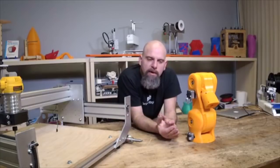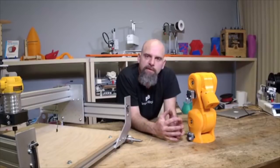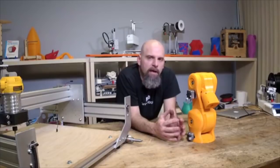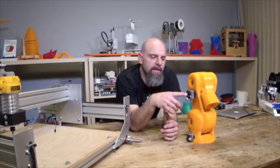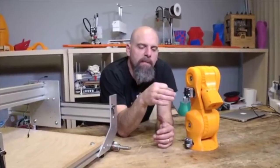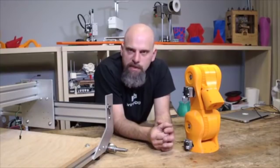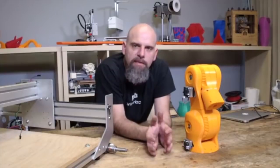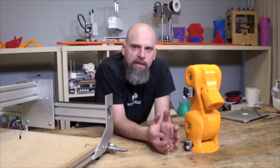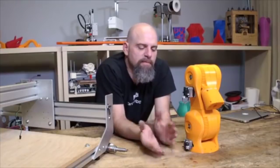But it's hard to get a gear train, a little transmission, that really gives you a high gear ratio, like 100-to-1. If you had that, you could use even smaller motors. This would be direct drive, 1-to-1. But in KUKA arms and such, they use extremely expensive, fancy zero backlash gearing. I can't think of the name of it. It's protected by patents, and they're very expensive, like $400 per motor for this little transmission thing that's really cool, but you can't use it. It's too expensive. It's all stainless steel and all this. Works good, but too much for a guy like me.